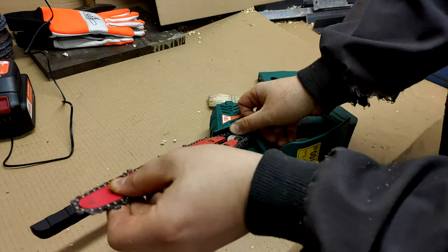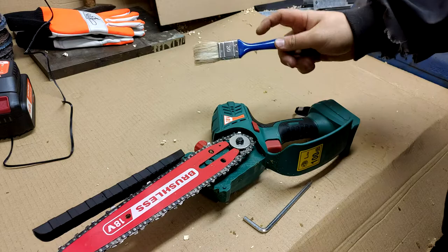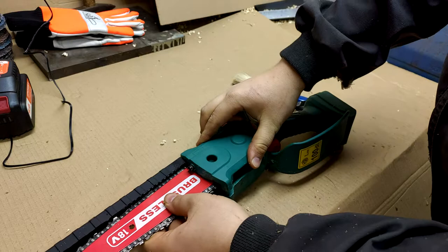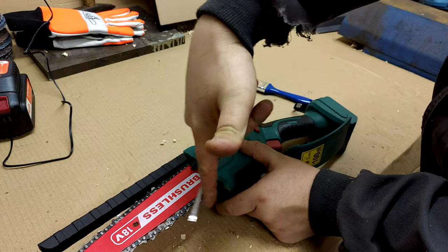My tip for this chainsaw would be conditioning sharpening for every 2 discharged batteries. You need to buy a 3.2mm round file from steel and a tool for limiter teeth. I heavily recommend watching some sharpening videos here on YouTube. Now, when we have our chains sharp, we only must think of one rule. Always refill your chain oil after putting a new battery on.